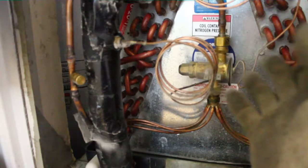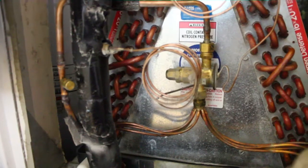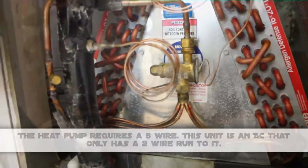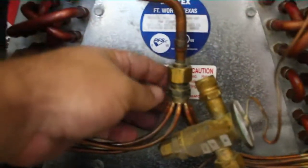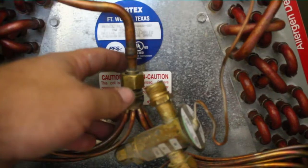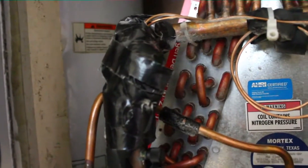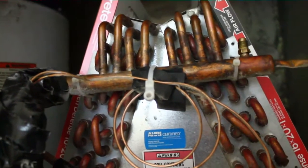Remove this thing, I'll leave the piston out, blow it out, and then we can put the piston in, solder in our outdoor unit, and get on with our business. We will have to run a new wire for the heat pump, but that's okay — we're only going about 10 feet or so. The TXV is removed here — I'll save that. Put our connectors back together. Piston is not in there; after we finish blowing it out I'll take this back off, drop the piston in. I still have to remove the sensing bulb because it's wrapped heavily, so I need to go get something to get it out and cut that tie strap.